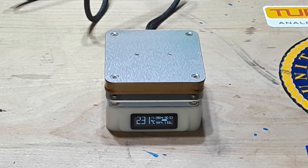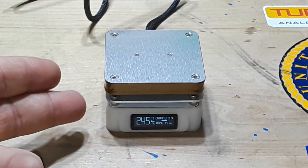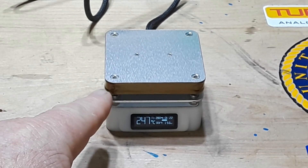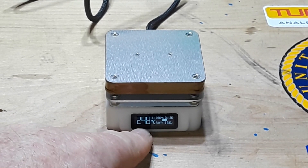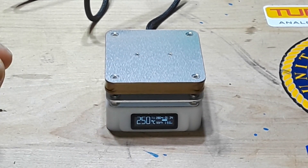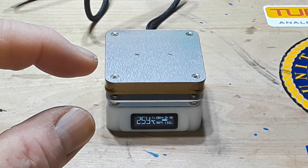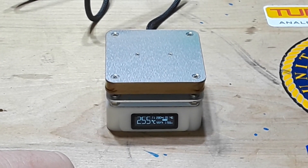It's been heating for about 30 seconds and we've reached 231°C. What's going on here is a PID calculation — Proportional, Integral, Derivative. It's doing PWM, sending pulses on/off to put heat into the plate. The PID loop looks for errors in overshooting or undershooting, and over time it adjusts those three parameters to decrease those errors and get very close to the target temperature.